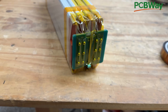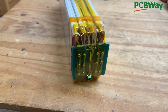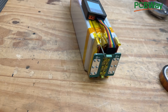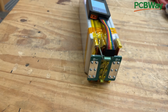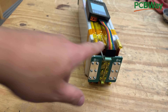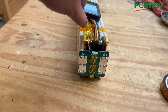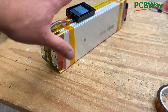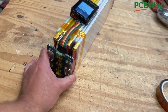These cells are designed to be laser welded — that's the original design. But a lot of people have successfully been mechanically attaching cells to systems like this, and that's why we built this system. This is just a 4S design, but if you need 7S for 24 volts, 10S for 36 volts, 14S for 48, or 20S for 72 — you're going to be able to do it just like this. I'll have another version of this with dimensions changed for people that want to use the holders. These cells come in holders, and I'm going to make a video next for that.